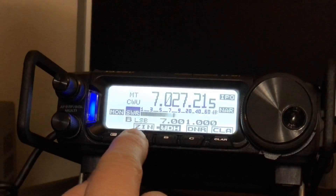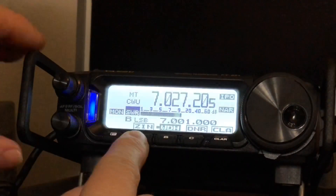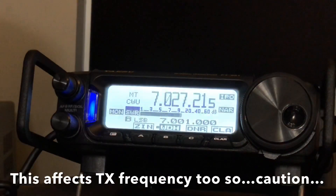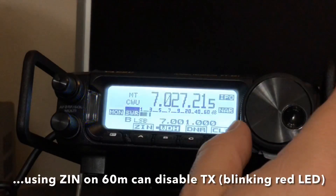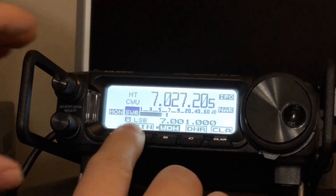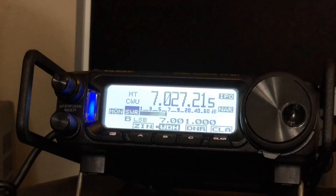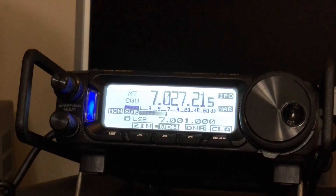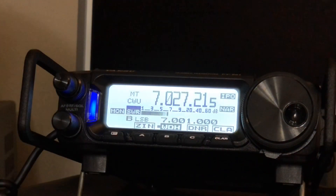Alright, and so watch — you just tap it and it will adjust my receive frequency. In other words, if the other station is a little bit off frequency and yet I want a 600 hertz tone, the receiver is going to move. Because when you move the VFO you change their pitch, but I want 600. So — zero in. There we go. You've got to make sure you tap it while they're sending, by the way, so it's got something to lock on to. The more you get that light to go blue, that's indicating that you have indeed locked on to the proper frequency to give you 600 hertz tone. If it's not on a perfect zero it just means they're a little bit off frequency.